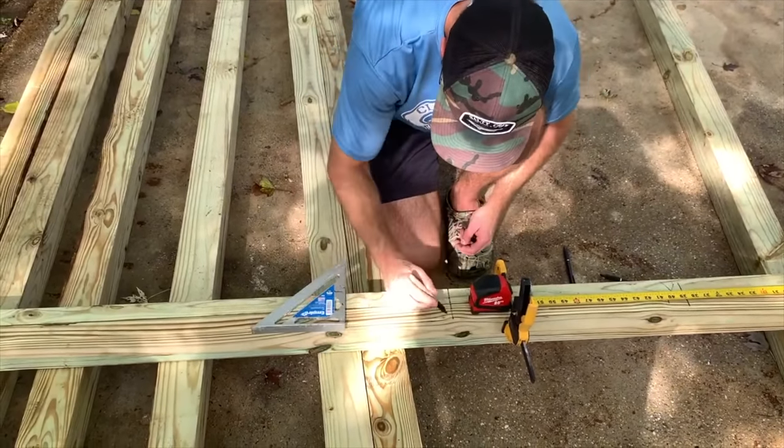Here I am installing a conduit clip to hold that vertical piece of conduit in place. And now once you've dry fit everything, you're just going to go back, apply the conduit PVC cement, and glue all of the fittings together. As you can see right there, I have a coupling to attach that straight run of PVC conduit to the 90 degree bend. And as I mentioned before, I highly recommend that you thread the cable through as you go. It's harder than you would think to actually pull that cable through. So working piecemeal is what I recommend.